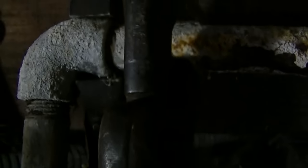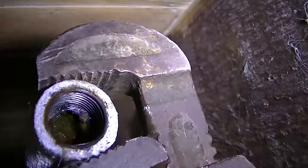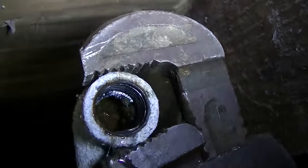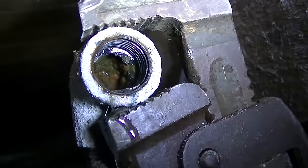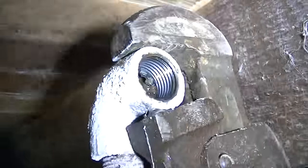You can almost be guaranteed that's why this pipe EOL'd. The cold water over there looks like brand new — electrolysis just ate the zinc plating, just killed the zinc. Alright, two pipe wrenches, push and pull. Well, luckily it actually unscrewed, and this thing's not really plugged up at all — actually looks pretty good in there, considering it's close to a hundred years old.